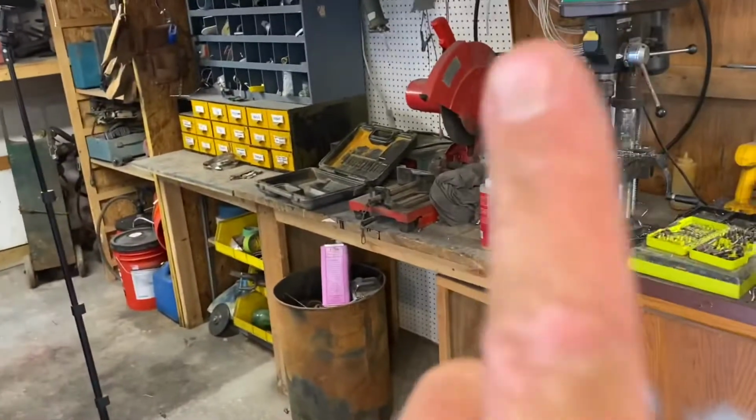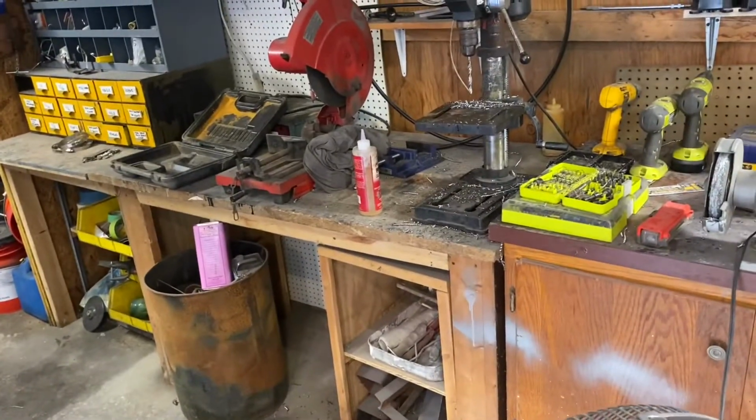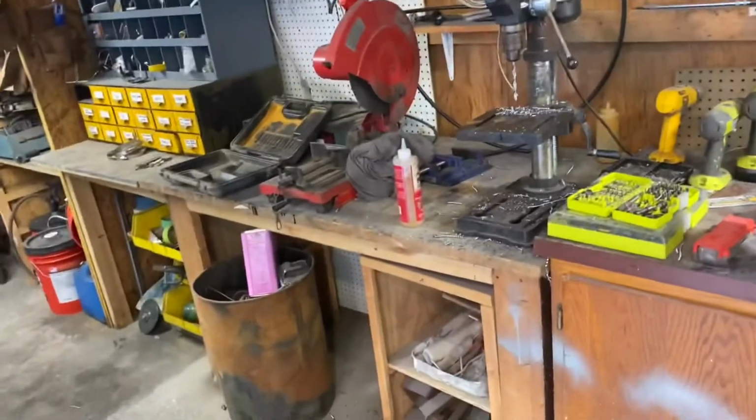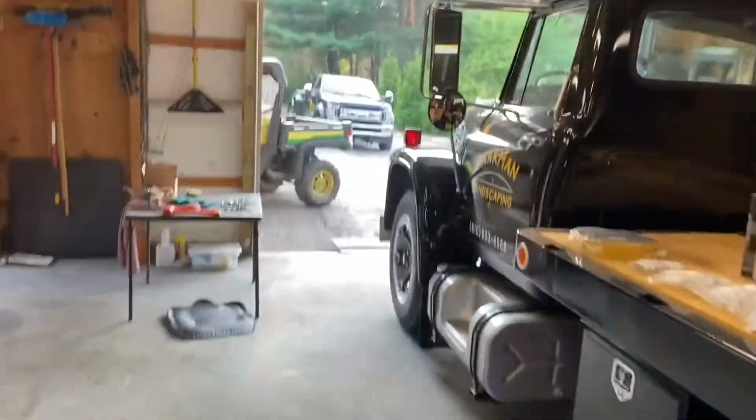That was one drill bit, one cheap hardware store Irwin 5/16 drill bit. Obviously the trick is 1, drill slow, 2, plenty of cutting oil. And I did a great job. So that being said, I'm gonna go enjoy some delicious Mediterranean food that my wife made.